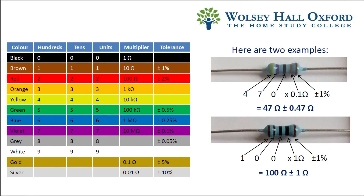How do I know that? I know that by looking at the coloured bands. This table shows what each of the colours stand for. The first three bands make up a number. For example, 470 is yellow, violet, black – although I think that looks more like a lime green than a yellow, but trust me, it's meant to be yellow. Anyway, the next band is the multiplier. Gold is 0.1 ohms, so 470 times 0.1 ohms is 47 ohms – that is a 47 ohm resistor. The brown band on the far right is the tolerance.